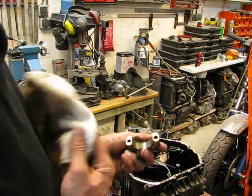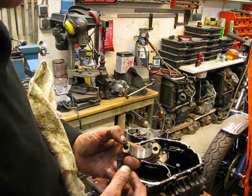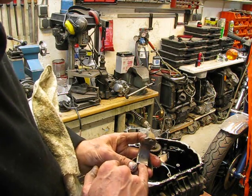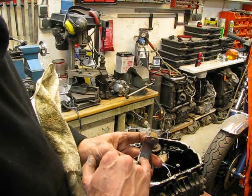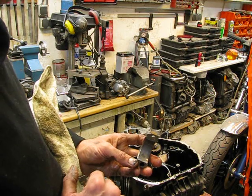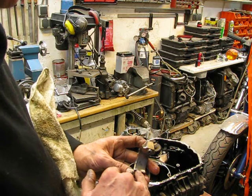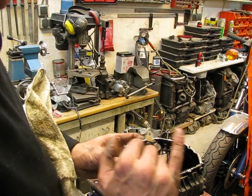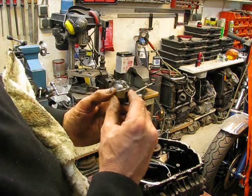The other side is completely gray. That's not the biggest problem. I can see a failure there, and that is strange. You can see almost the layering on top of it. I think liquid water or something like that has killed this bearing. It's very strange because there is no special material left — only the carrier of the bearing itself. And that's not what I want to see. So there it is gone. Completely gone.